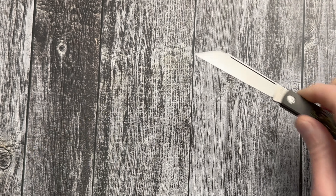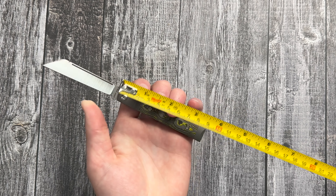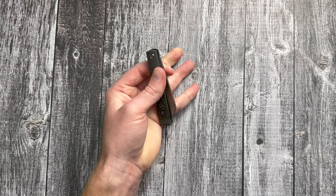But that really isn't the goal of this pattern. This, for most people, is probably going to be more of a desk knife or a gentleman's knife, utility knife. Four fingers for me, sure, but I prefer to sit back a little bit anyways and have my pinky around the corner a little bit — that's the most comfortable position for me, and then you're not running the risk of accidentally pushing down on the spine. Overall length is about six and three quarters, blade length is about three, cutting edge closer to two and three quarters, handle length three and three quarters, and stock thickness is always three millimeters. Handle thickness just a little bit under half an inch.